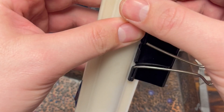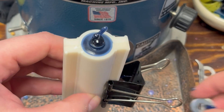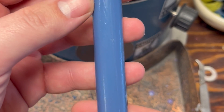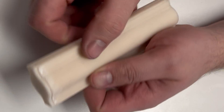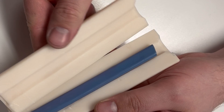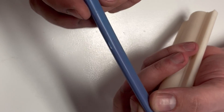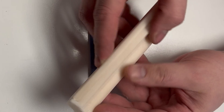We were able to just put a washer on the top and some binder clips on the sides and inject wax in. The surface finish is glassy — it's beautiful. You don't have to do any kind of silicone mold spray, so that's excellent as well. We also did some different shaped sprues — like a double wide, because we needed more material flow into the cavities without more sprues. If you're familiar with casting fine silver, having large sprues to feed into that material makes sense.